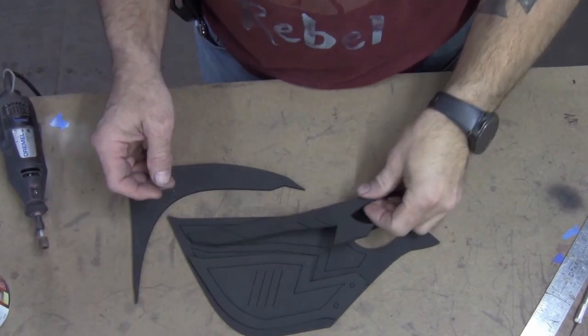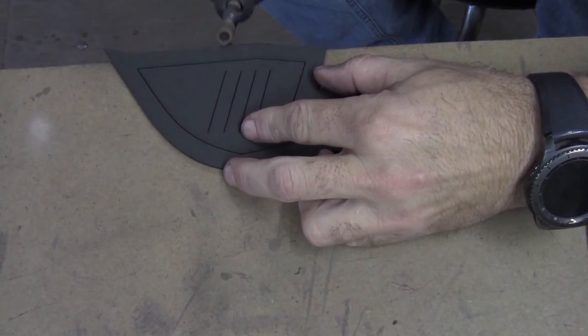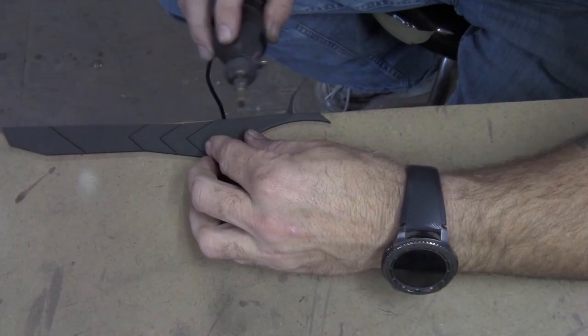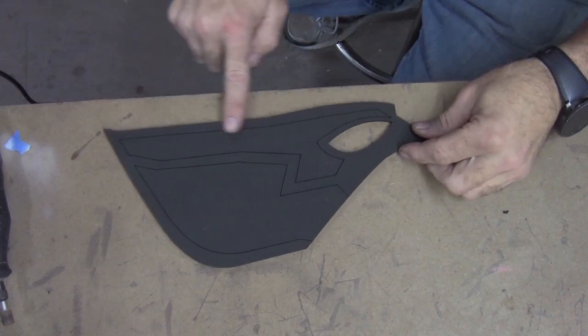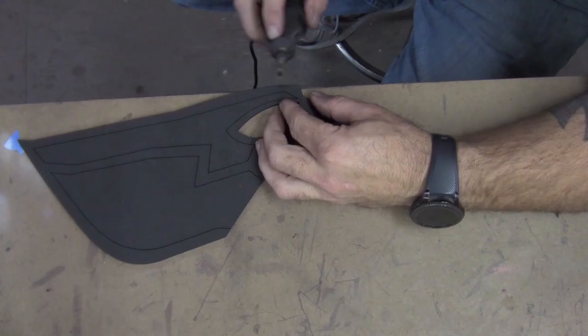Now grab the pieces to make the ear sections. On your overlay pieces, I recommend using a rotary tool with a grinding stone to round over the top edges all the way around. On the outside earpiece, I recommend making a bevel on the bottom, back, and top edge. On the short edge at the front, you'll want to make a rising bevel from the nose to the top edge.